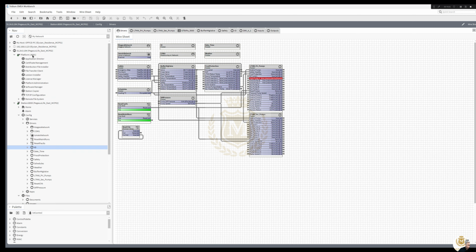Like I said, the ports are different, so the platform port, instead of 5011, it's 8001. I'm using the Spitfire, so I can use one IP address and I can have lots and lots of stations. I use 4 ports per station or per controller. 8000 is the station, 8001 is the platform, 8002 is the web page for the viewer on the panel, and 8003 is my connection into my M2M Pro router. Naturally, the next station was going to be 8004, 8005, 8006, 8007, the next one 8, 9, 10, 11, and so on. So one IP address, lots of different controllers.